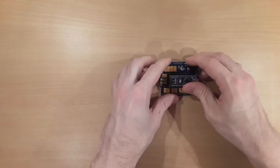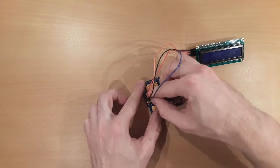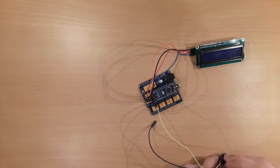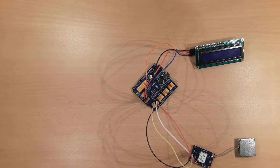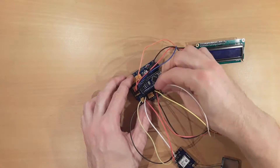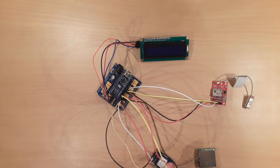Here you can see how I built up the test setup. I used an Arduino Nano in combination with a very handy shield. First I added an LCD display module in order to show debug messages while I'm field testing. Then I connected the $7 module and the $3 module to the Arduino. In my program, in order to retrieve the GPS coordinates, I used the well-known TinyGPS library. Lastly, I added an SD card module. I store the GPS coordinates as GPX files on an SD card. GPX stands for GPS Exchange Format and is an XML-based data format for GPS data. The advantage is that there exists a wide variety of tools, for example for visualization, that work with this format.